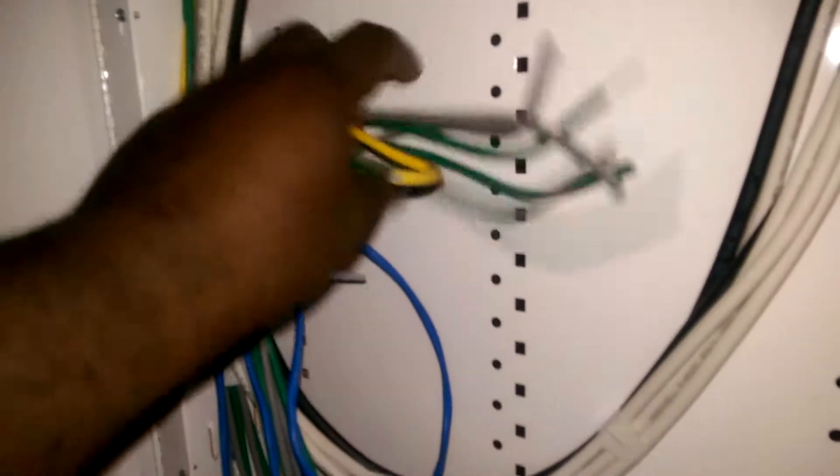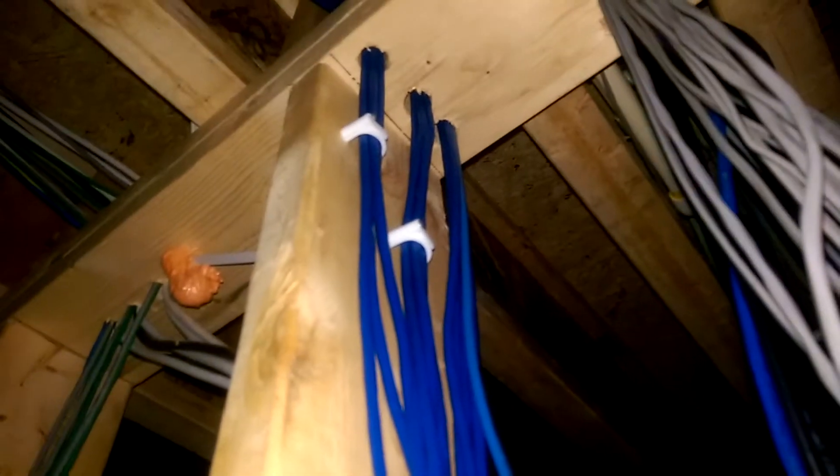You can see right here what the builder gave me: a couple of CAT5 cables, some coaxial cables, and so forth — four drops total. Over on the right is what I completed over the last three weeks, about five solid days of work on weekends. The blue cables are my data cables — I got about 1,000 feet of data cable from Monoprice. The gray cables are speaker cables, and the black cable is CAT6 which I'm using to control the Whole House Audio.